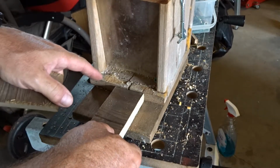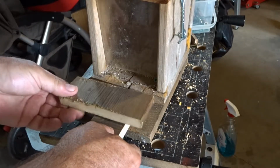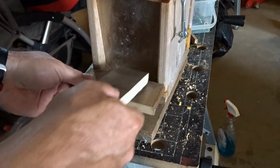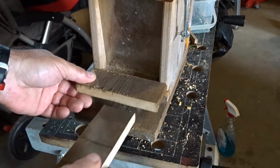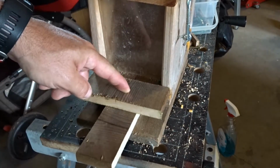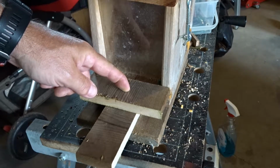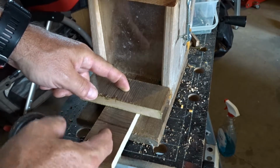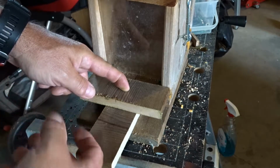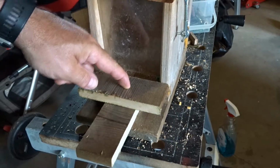And if you notice here, my old ledge, I took it off, it was falling apart, but you need to contain the bird seed. So this is going to basically sit there and contain the seed down in that area. So I think that'll work out pretty good. Might look a little bit silly, but I'm sure the birds won't mind. So I'm going to go ahead and pre-drill some holes, and again, I'll use those same screws. They're short enough that they won't go through the bottom, but long enough to hold all the wood together, so I think it'll work out fine. Let's get those screws in.